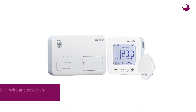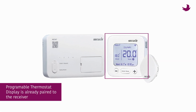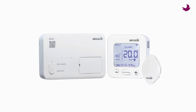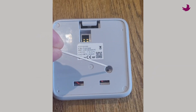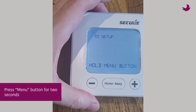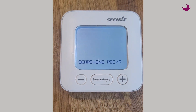The first step is to appropriately wire and power on the receiver. The provided thermostat in the box, or programmable thermostat display, is already paired to the receiver and will control zone 1, terminal 1. Next, wake your thermostat by using the hole on the back of the unit, then press the menu button for two seconds. Your thermostat will then search for and find the receiver and will now ask you a few simple questions.